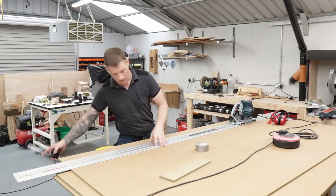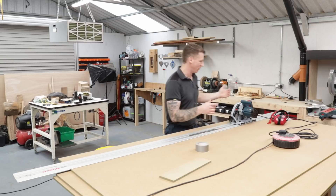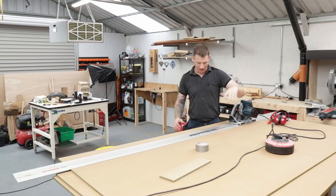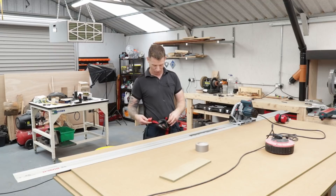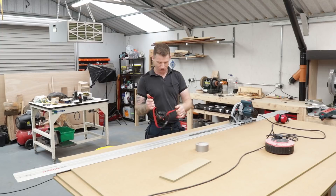I'm set up to make the cut. It really takes seconds to set up a track saw — just measure both ends, it's a perfect straight line and you're good to go. A little bit of advice: keep your cords out of the way because they can get caught on the track and pull it off line. I've just an extension lead set up to keep the cord off the track. Also watch your air line or hose for your vacuum — that can pull the track too. Working with MDF, always wear a respirator, always have a dust mask on because you do not want to be breathing this stuff in. It is not good for your lungs whatsoever. I'll have the air filter running and it hooked up to a vacuum.